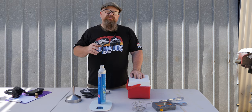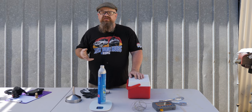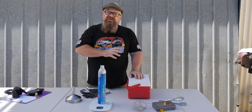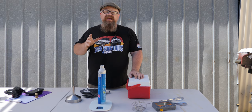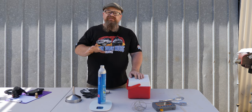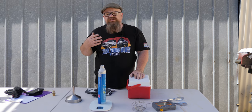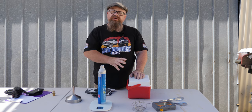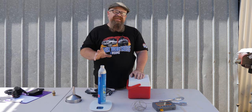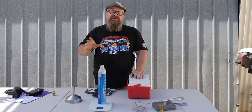A little bit about dry ice: it's basically solid frozen carbon dioxide, and it sublimates — that is, turns directly from a solid to a gas at atmospheric temperature. You can't really keep it in the freezer, so you need to purchase it and then fill up your container straight away. Our tare weight is 618 grams; after we put 400 grams of dry ice in, that gives us a total of 1018 grams — canister and dry ice, without the burst valve assembly on top.